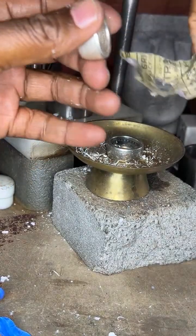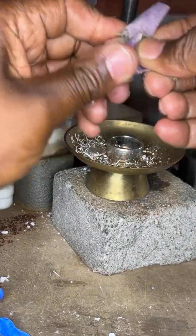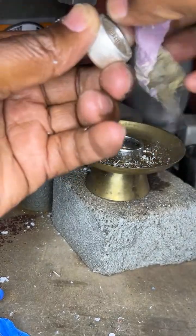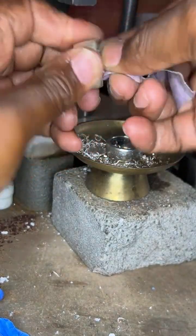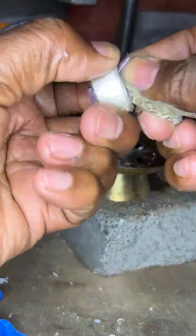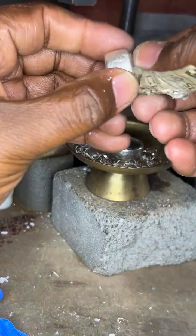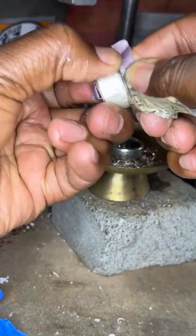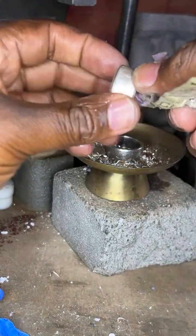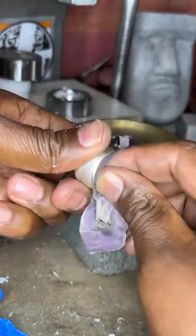All right, when I clean the coin, now I can clean the inside. Like so. I'm going to take some 320 grit paper and just clean it in, just like so. Clean the inside. You want to smooth all those rough cuts because you don't want the ring to be uncomfortable. Okay? It's real important. You clean that with the sandpaper, then you go around the other side and do the same thing, just like so.